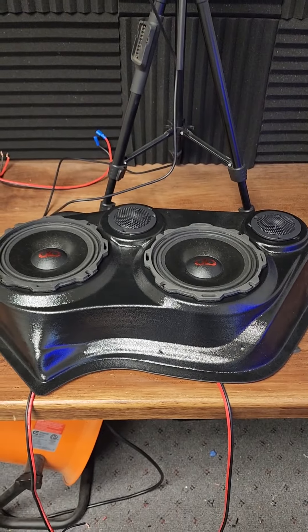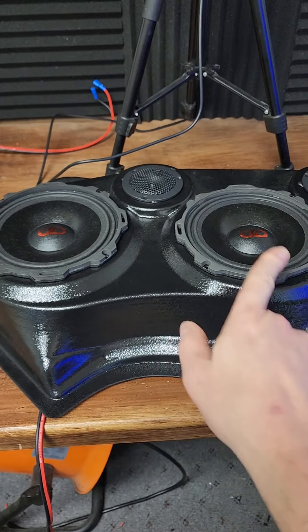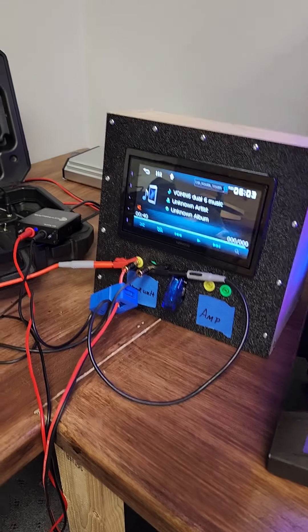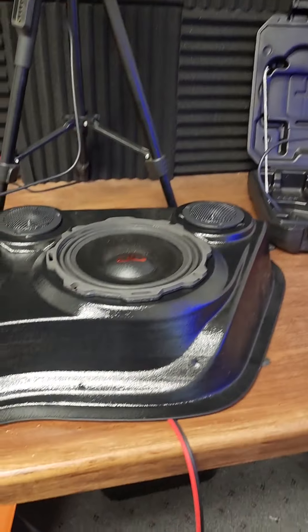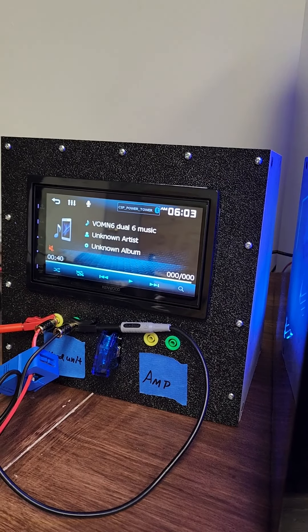Today let's talk about speakers. In my shop office I have this setup here. We will be discussing what happens when you take a six-and-a-half inch speaker and another six-and-a-half and wire them together and run them off a head unit. We do have an amplifier but today we will not be focusing on that. I also have tweeters set up, but first thing we are going to discuss is what is a woofer and what is impedance. Impedance is the resistance that a speaker shows an amplifier — in this case the amplifier built into the head unit.